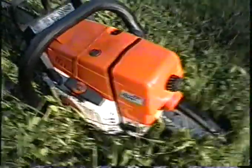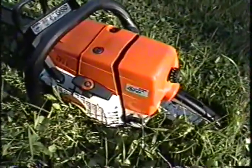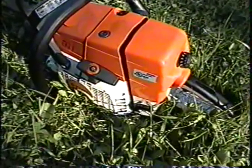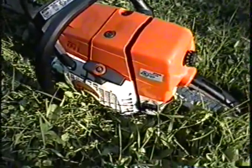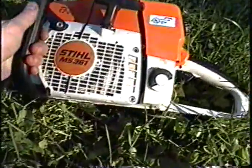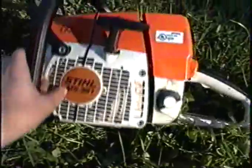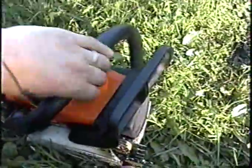You can see that a coil can be defective — it can work at low speeds but not at high speed. The rev limiter in this coil had gone defective, which was very confusing. It almost seemed like there was a bad bearing or bad crankshaft or something like that. But I took a chance, put in a new coil for 90 bucks Canadian, and the saw is like new again.